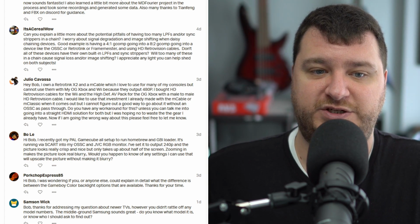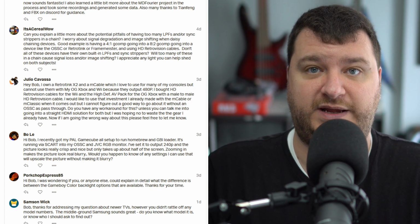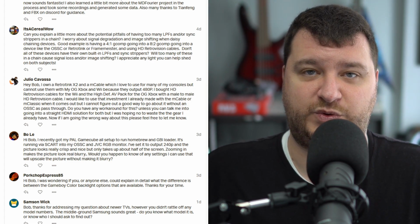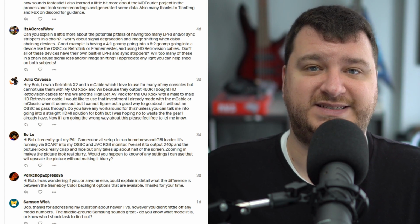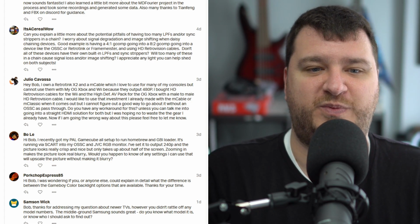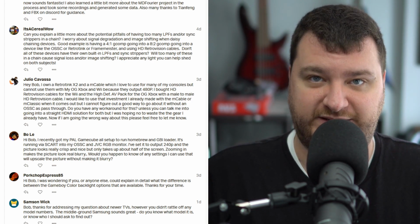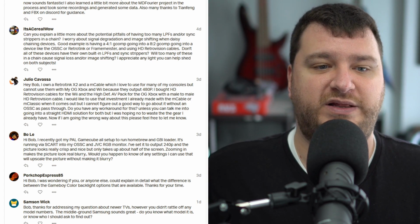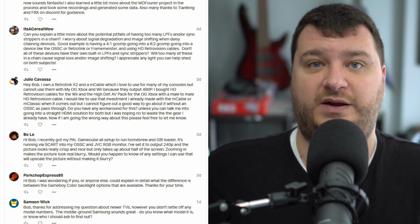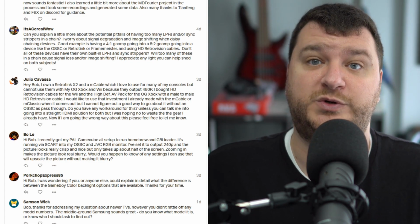So it's really just a matter of, if you had a bunch of sync strippers in a row that all had a proper circuit, you would get image shift because it would technically shift over by 1 pixel each time it passed through, but it really wouldn't affect anything and it wouldn't be unsafe to use. The issue that I have is, how do you really know that any of those random sync strippers were built correctly? And that's my worry. So let's say you have an older mod for an N64 that a random seller built, with a sync stripper in it, and didn't do it right. And now you're having too much voltage come out.